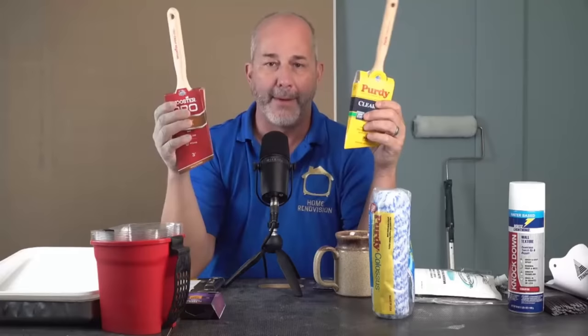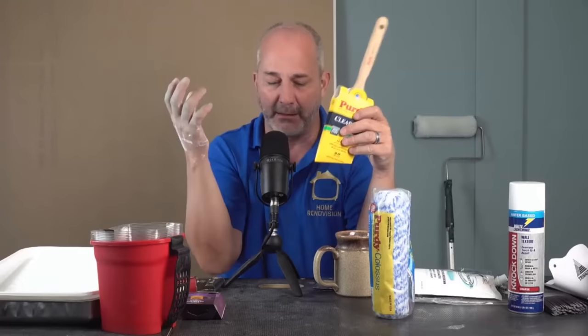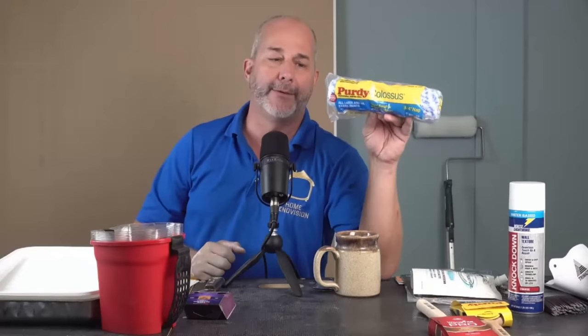Now the great company Purdy — I brought this brush to show you the difference. This one's called ultra stiff and this one is soft. A soft brush is for cutting in on your wall paint; the stiff brush is for painting your trim. A soft brush leaves lots of paint on the wall, which is good when cutting. The stiff brush leaves very, very little paint — and when you're working with semi-gloss on your trim, windows, and casings, less is more. Put as thin a layer as possible for the best result, usually two or even three coats. The stiff brush gives you the best result without that drippy, hangy look.